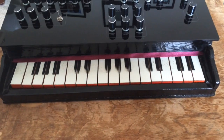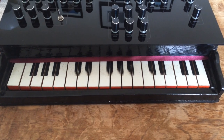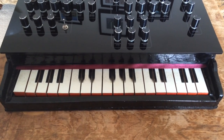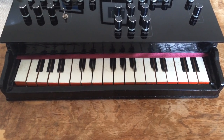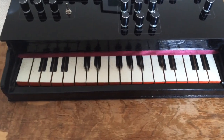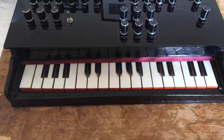To trigger sounds you use this keyboard. It's got 18 keys but there are no black keys — they're just painted on. So essentially it's just a line of buttons, and for that reason I've allowed it to be configured to play many different musical scales through a panel control. The keyboard is completely velocity sensitive, so depending on how hard you press the keys it sends a different message which you can use to modulate parameters. It can also send MIDI polyphonic aftertouch, which is pretty cool, but this is only available through MIDI out and not in the internal synth engine.